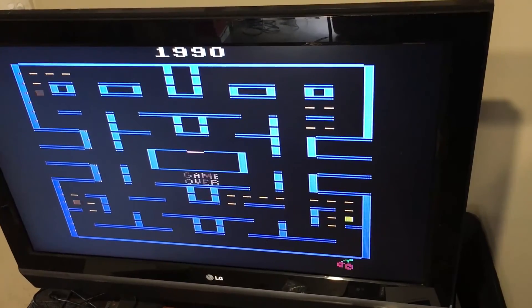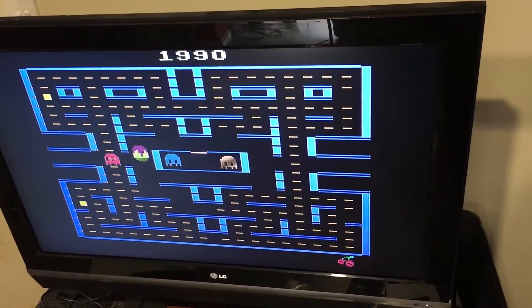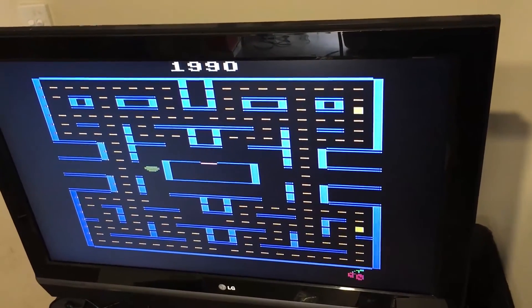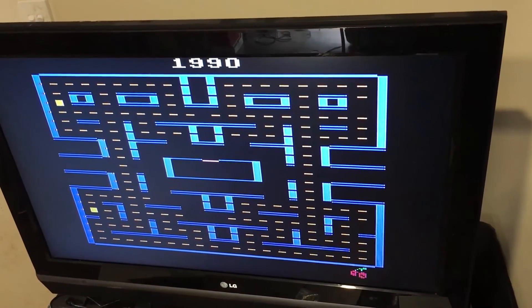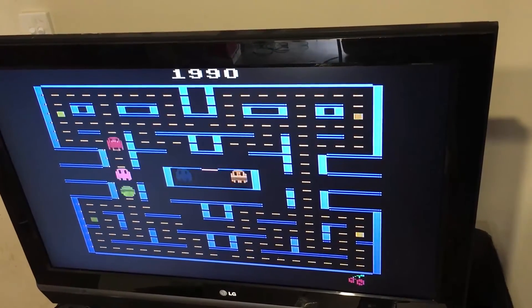That's running someone else's homebrew and it works. But now it's time to see if I can get my own code on an EEPROM and see if it works with this cartridge. I'm pretty sure it will. I'll get a test pattern running, and that will be the start of a new smaller game. Here's some code that I compiled on my computer, burned to the EEPROM, and I'm now testing it on my Atari. Now I know how to make Atari cartridges that are 4K maximum. It's not a bad start, and I can compile my own code.